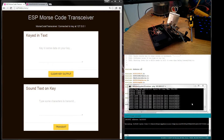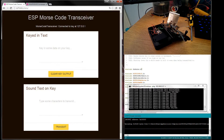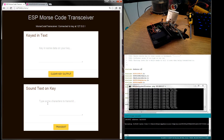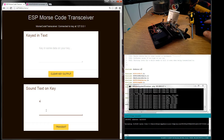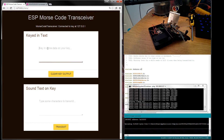I'm going to go ahead and start it up — you'll see it connect here shortly. There it is. I can come over here and refresh. I've actually cheated a little bit: I'm running a local dev environment here, but it's the same stuff that can be served right off the ESP. It occurred to me it'd be really cool if the server could answer you back with confirmations — like if you say 'turn on the light,' it would say 'okay, light is on.' So I added a debug slash learning console connected with WebSocket. I can send anything I want. Let's send something easy — it sent an S. Let's send an A — that'd be a dot-dash. And then this is where it'll actually read data in from the key.